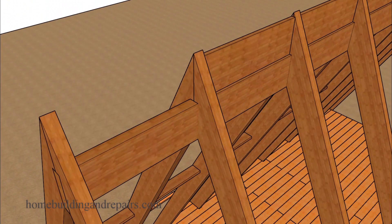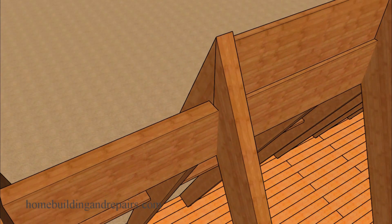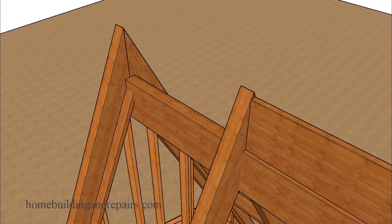Let's remove the block to give you an idea of how the rafters are going to sit on top of the beam. You don't need to use this beam — you can have the rafters connect to each other and then install blocks here, as long as you have the collar ties or the rafter ties to keep everything from spreading apart.